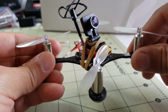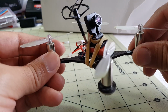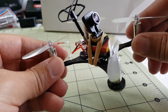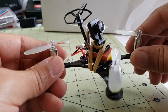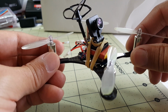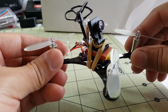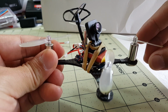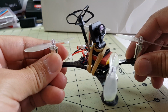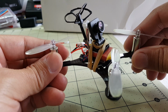If you see anything in the flight video that indicates something I need to lower or increase, let me know. I'm still tweaking it, but with these last values it flew reasonably well, enough where I could control it and predictably point it where I wanted it to go. If you're building this, I would highly recommend starting off with those PIDs instead of the stock ones, because it's basically unflyable on the stock PIDs from Betaflight.